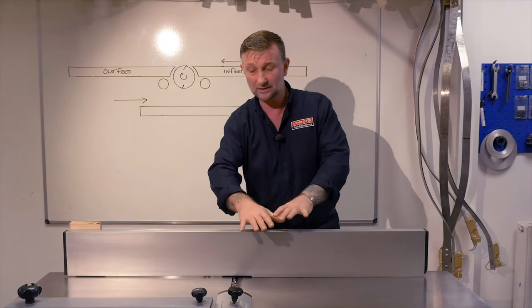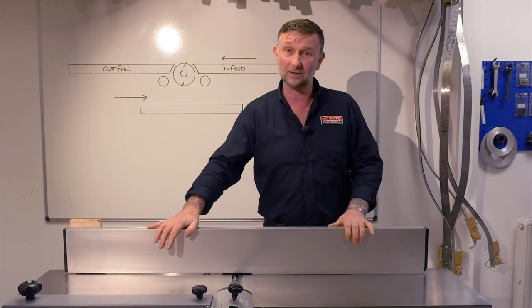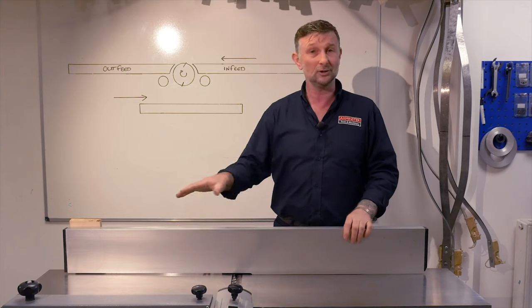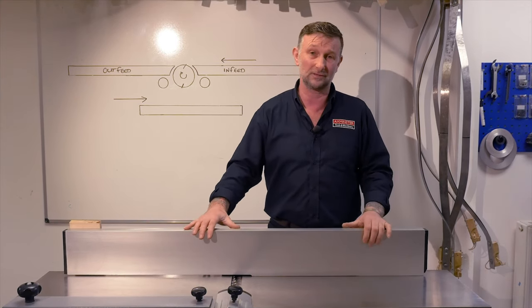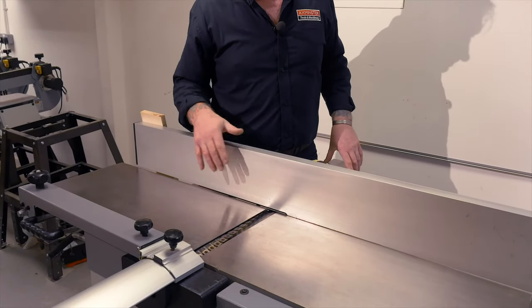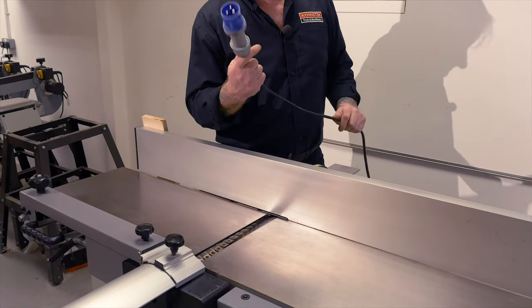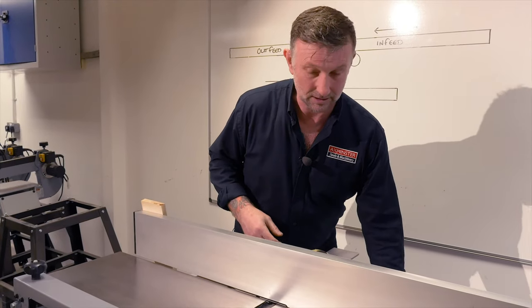Although we're using this high level spiral planar thicknesser, some of this thinking can carry over to all planar thicknessers, so you can use these setup tips to set your planer thicknesser regardless of type. The key thing before you start getting into the cutter block and start adjusting tables and getting close is to ensure that you've unplugged, every time. Not just switch off, unplug just in case.